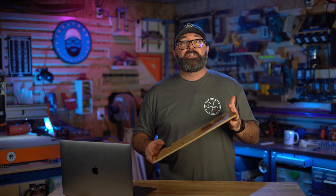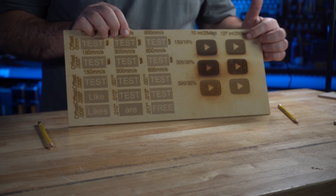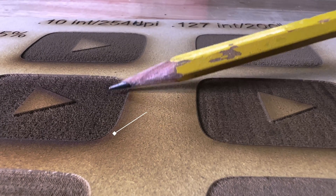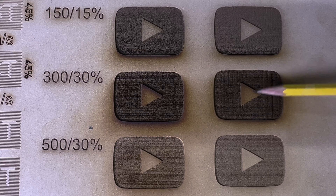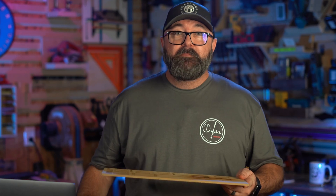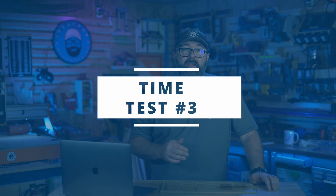The engraved portions appear similar but the noteworthy difference is the significant reduction of soot buildup. If you look closely, the laser chars the lines which will generate smoke. With closer or overlapping lines, the material receives additional heat from the next line, resulting in more soot production. I decreased the power setting and re-ran the test at 20% power, and I got a much better result at 20% instead of 30% power — it looks a lot closer to the 150mm engraving. The engraving time for this test was 15 seconds less.